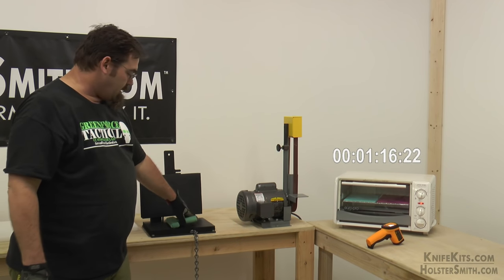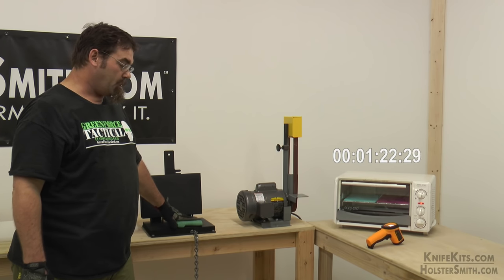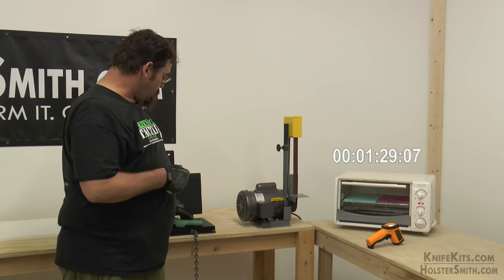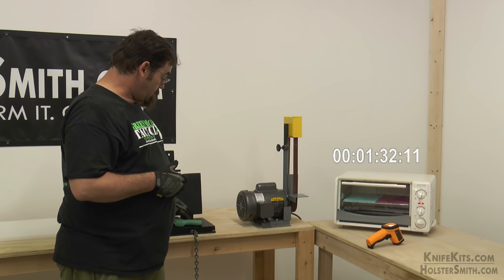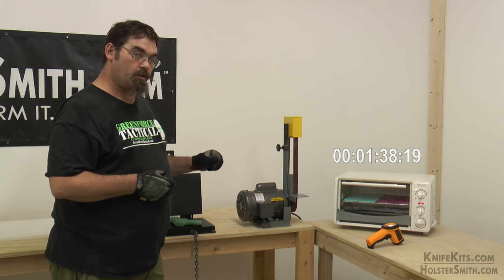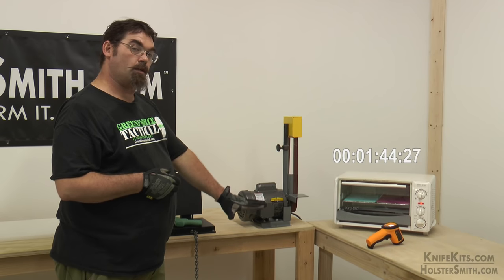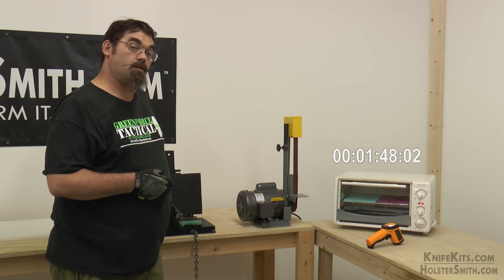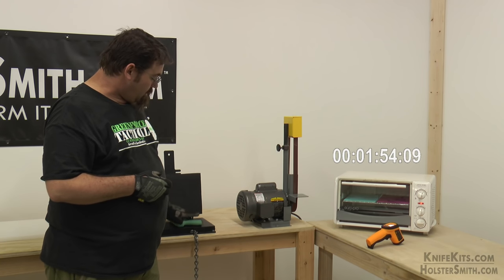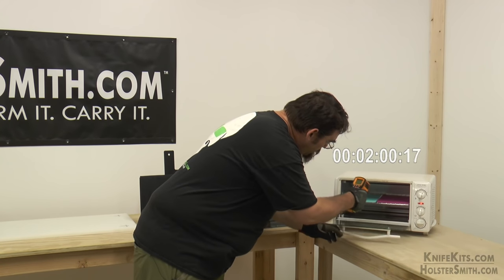Let's talk a little bit about speed. You want to make sure that everything that you need to do your mold is all ready to go before you start heating your KYDEX. While your KYDEX is heating, it's an excellent opportunity to check and make sure everything's like you think it is. Because once we start moving the KYDEX from the oven to the press, the faster we can do that, the better definition we'll get. As soon as we take it out of the oven and take it away from the heat source, the KYDEX will be cooling and coming back towards ambient. And we want to mold this stuff in excess of 300 degrees. So when you take it out, move it quickly to the press, get the press closed quickly, then you can have a snack. So we'll go ahead and take a chance here and see where we are.